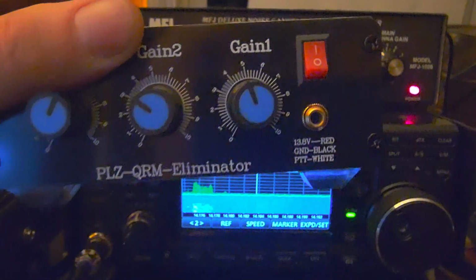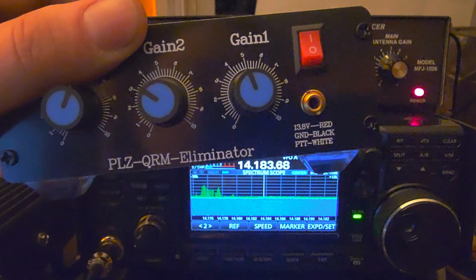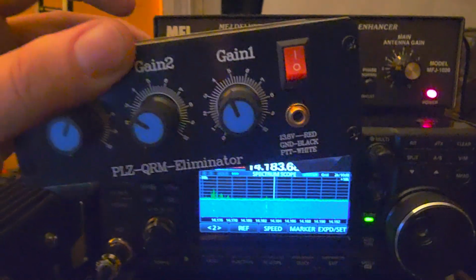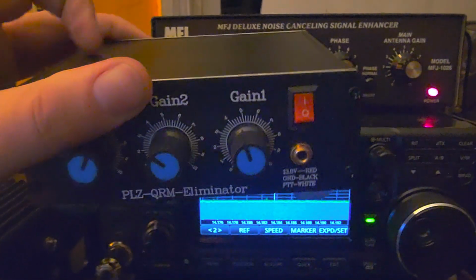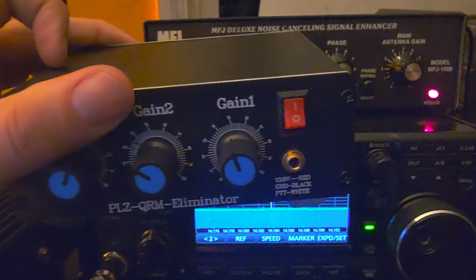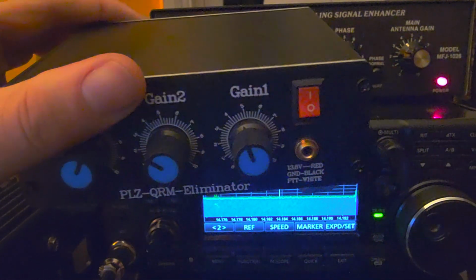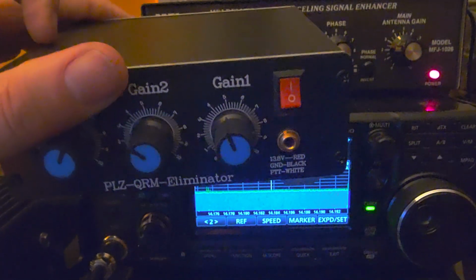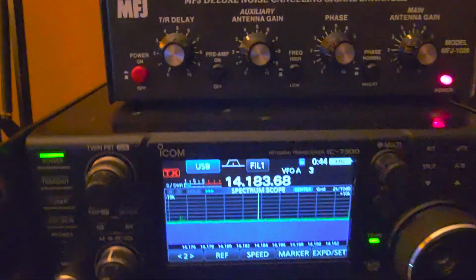What's annoying about that one is if you look, the PTT switch, which switches it offline when you transmit, and the power are on the same 3.5 millimeter jack, which is ridiculous. So I've not set this up yet. It'll be easy enough to set it up for receive, but I need to rig it up for transmit as well. So it's going to be kind of a pain to wire that up for power and PTT on the same jack, which I'm not looking forward to.